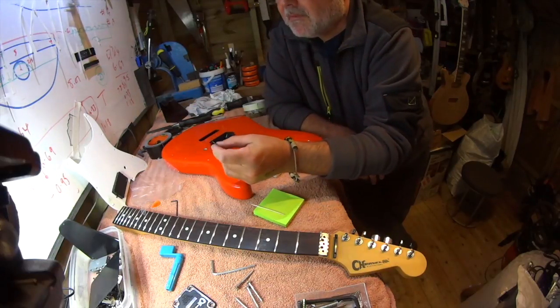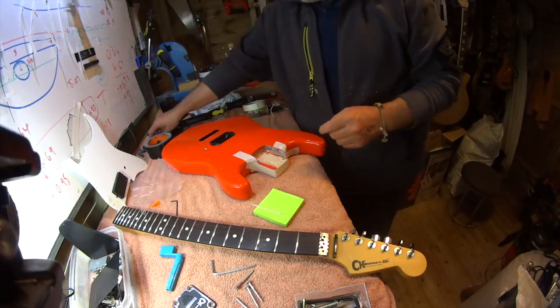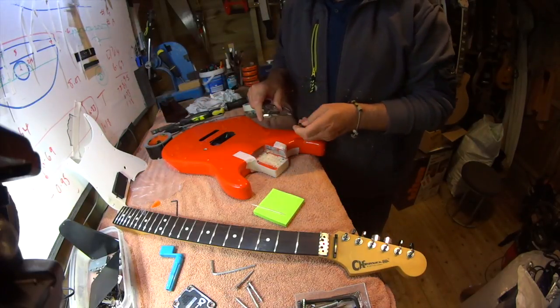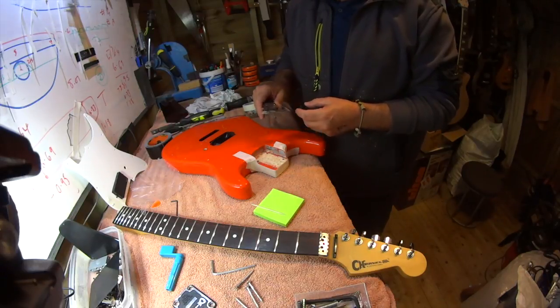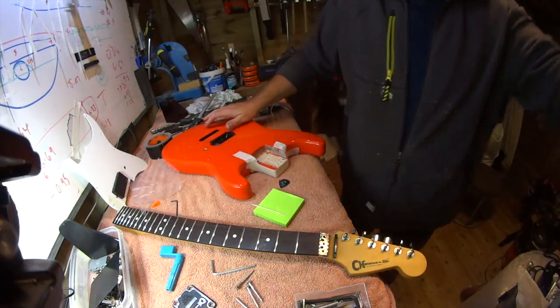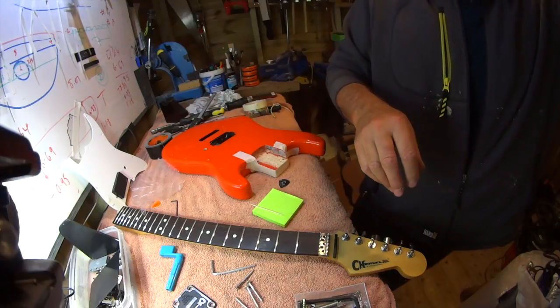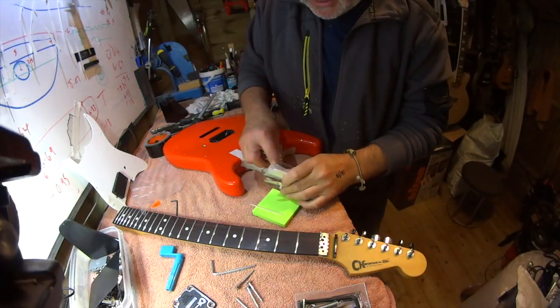That's at that point, so there's three, isn't it? We'll end up squeezing out the leftovers, but we'd end up with a kind of wedge-shaped fill. Alright, it's 0.6, and that isn't enough, so we do need a better shim than that. Now, I don't have access to making little tiny wedge-shaped things, unfortunately, much as I'd like to.